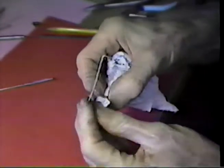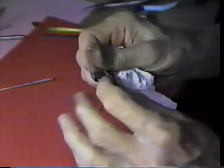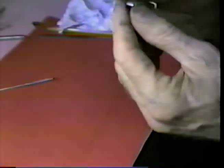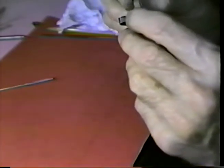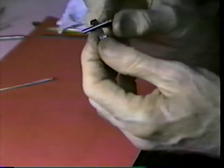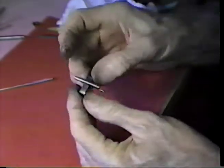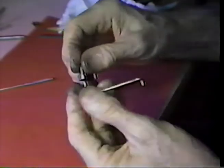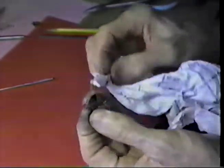Let's see what we look like after that brushing operation. I will need to look at this with the eye loupe to get a better appraisal of what's happened. The polish remains very, very good on the functional surfaces of the pallets. The discoloration from the heat treatment is essentially gone. You can see some evidence of it, and even with the material brightened, there is a slight difference in the heat-treated area from the non-treated area. Got some black. The wire brush was slightly oily from something that we've been using previously.